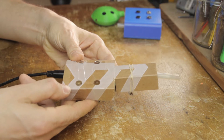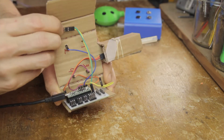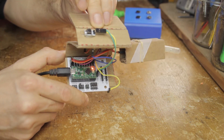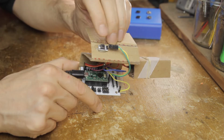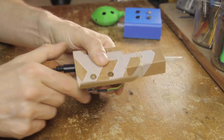If you unplug the instrument, the calibration will be lost. The way to save it is to press the button three times in quick succession, with no more than half a second for each press and no more than half a second between presses. After the third press, the LED on the TNT will blink three times, which confirms that the calibration has been saved.